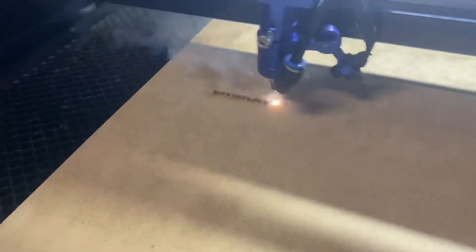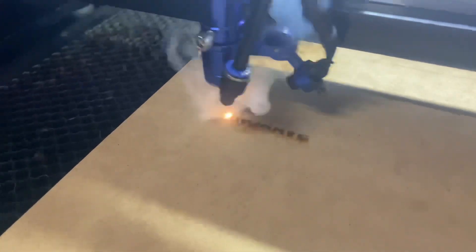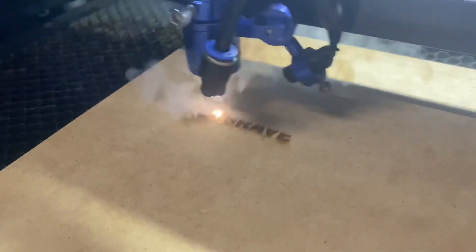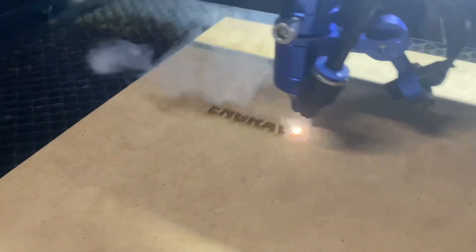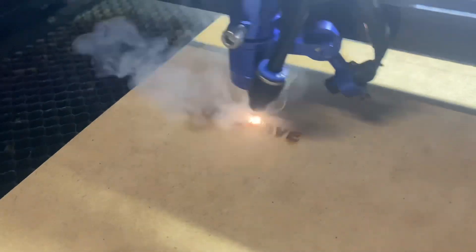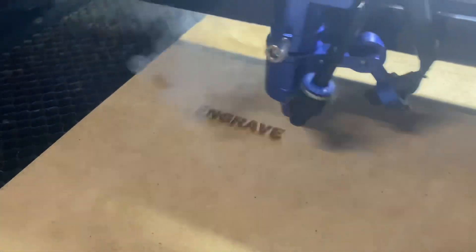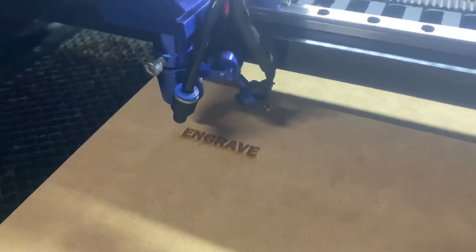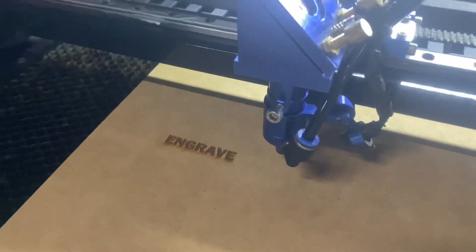If that's how you use yours, I just wanted to do a quick demonstration and show you how to do that. So I'm just going to do one here. At the moment this is running at 150 millimeters a second for speed, with 25 power. This is on my 80 watt machine and I'm going to increase those speeds a little bit so you can see the difference, and show you how to adjust the power as well.